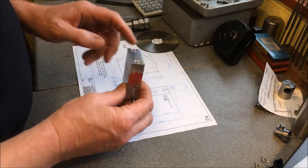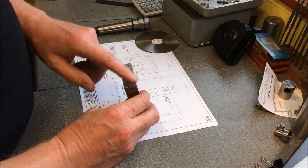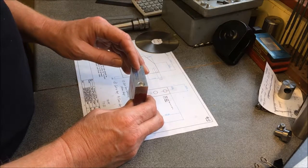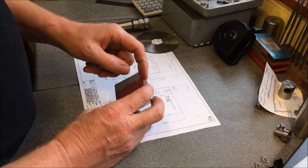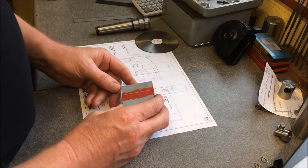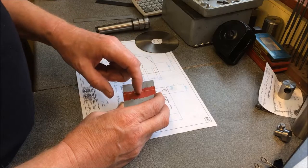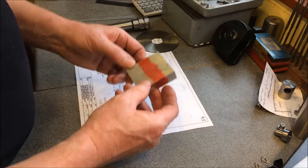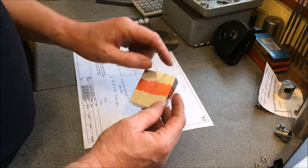I cleaned up the faces on both sides at the top and bottom, also drilled and tapped and counterbored for the clamp screws cap heads. What I need to do now is to split it, and then once I've split it I'll clean the split faces up, put it back together, clamp it, then center up using the split line and midway along the block to put the bore in. The drawing shows 23.2mm from this face here, so I've already marked that as you can see.